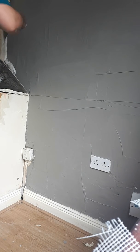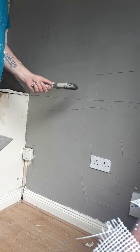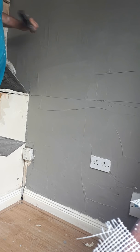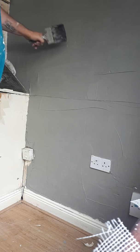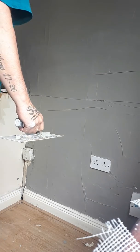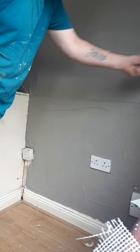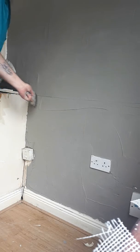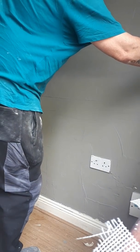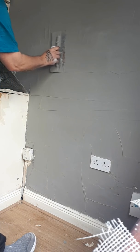Okay, so as I said, we'll do that now with a trowel, and you can use a sprayer or a sponge or a brush. What I do now, for another pass of this, is I'll just shake a little bit of the excess water off, so I have a little bit of water on the wall to work with. And then where I'm going, I'll give it a light brush. And yeah, people would say I would have to put the lines in it, but it's actually kind of pulling it all together. And when you come with your trowel, then it goes much flatter.